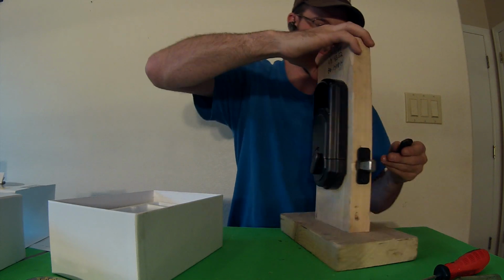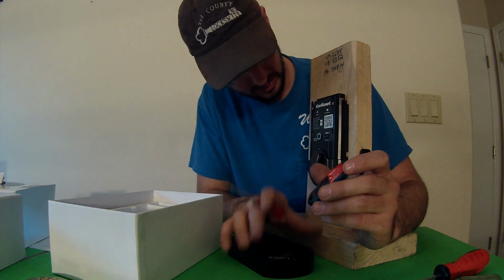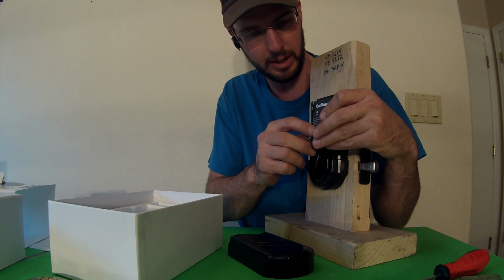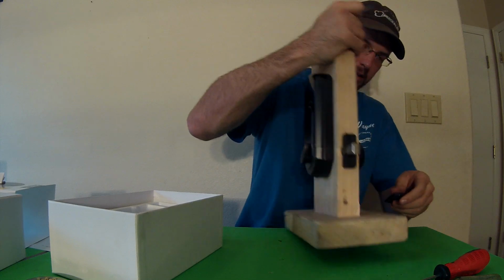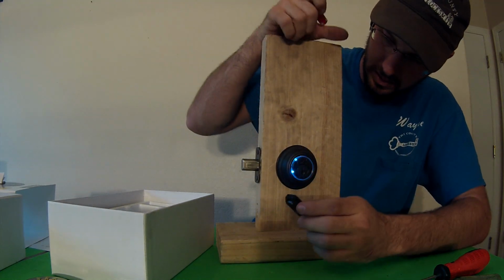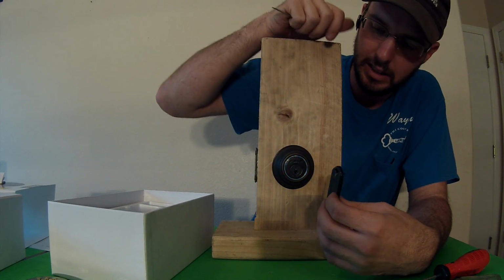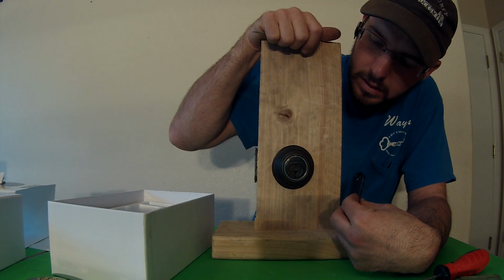And you'll need to take a pen or a little screwdriver and push this button here. You'll need to push this button here that's inside your key fob. This is the key fob that comes with your lock. I'm going to go over this because I don't have the iPhone to run it off of. You're going to push that, and then it should blink. And it should communicate with the lock now. Now that it's blinking green on the top, it should work. There we go. Once you do this three times to make sure that it's in proximity of you. Twice.